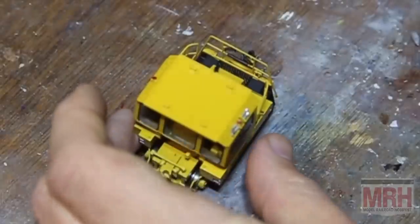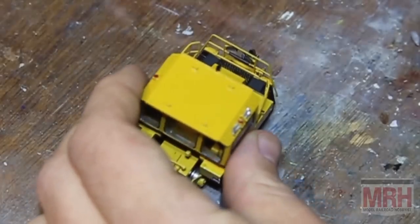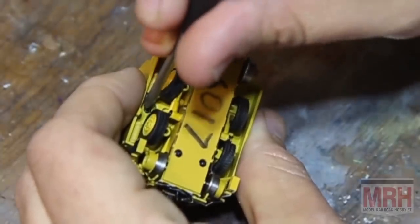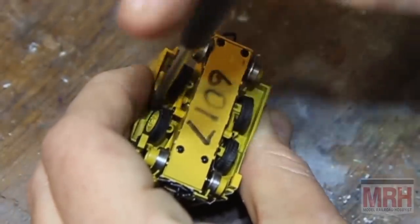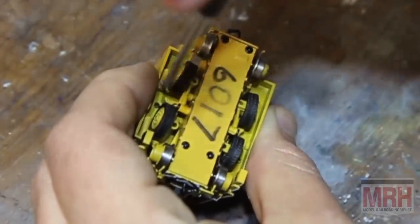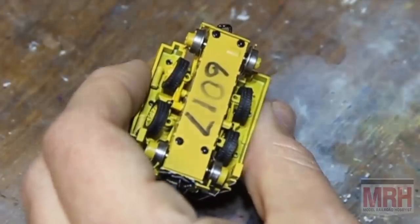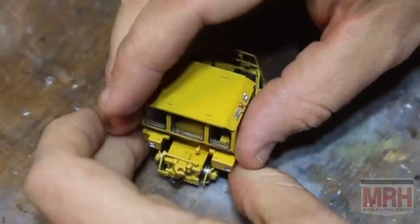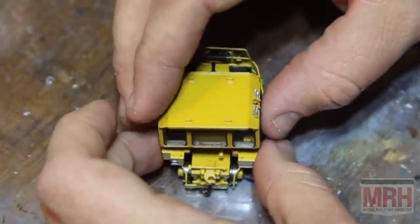Now, George Bogatuk has been a great partner in this project, giving me advice as well as helping me design a stay alive for this trackmobile. I carefully dismantled the trackmobile and looked for the best place to hide the decoder. The Model Railroad Hobbyist install had made use of the channel between the wheel sets to house the decoder, so I wondered if I could do the same with the TSU 1100. Unfortunately, the decoder was just a little bit too wide to fit the space, meaning that the cab would be the only option. This presented a new set of challenges.